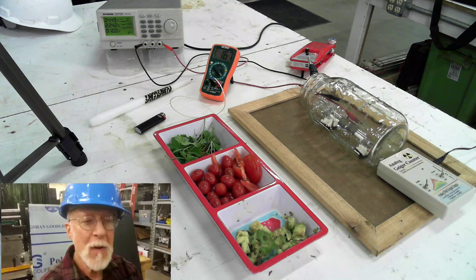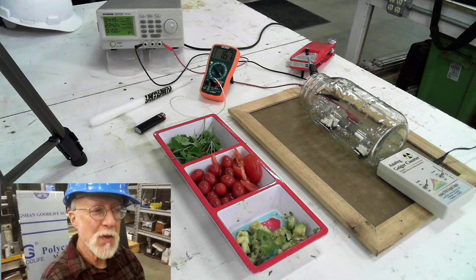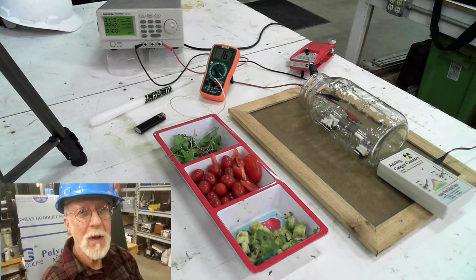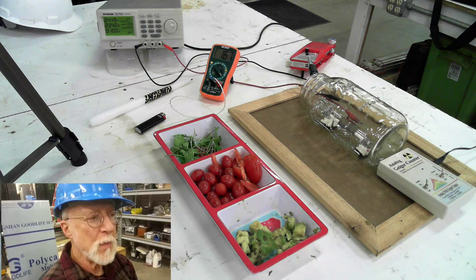And I kept adding weights until I ran out of things to add at about 34 kilograms, which is over 70 pounds, pulling those fittings off of the tube. And it just sat there happily, swinging in the breeze. I remember seeing those photos. It even looked like the thing was bending, but it wasn't falling off. At one point, the stainless steel tubing hook bent, but the tube didn't break, and the fittings didn't budge.